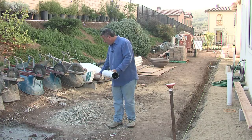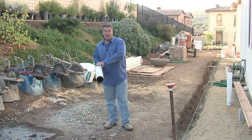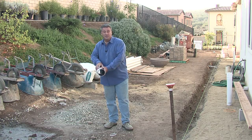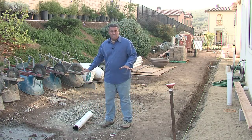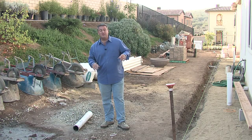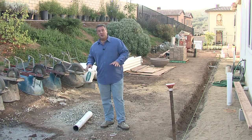French drains provide that path of least resistance — the water fills from below and carries off through the pipe. So this goes below into a bed of gravel. It's covered with a fabric material, a giant sock actually, that protects the pipe from being filled with gravel and dirt. That goes below the course. Then we grade about four inches of gravel over that, and then depending on the course and the homeowner's preference, we'll install decomposed granite, crushed oyster shell, or sand as the play surface.